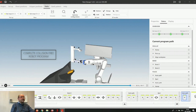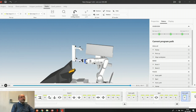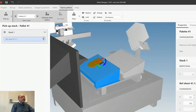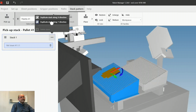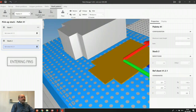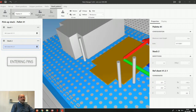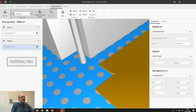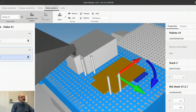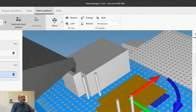This is done. What I can do now to make more autonomy in the cell — for example, I can make a stacked pattern. Here I can say copy this one in the Y direction, so I've got two now. I can enter my pins — I want the pin here, I want the pin here. This is for the operator, to shift his parts against. One here, and I see that this one is red now, so I need to move it a little bit more like this — that's okay.